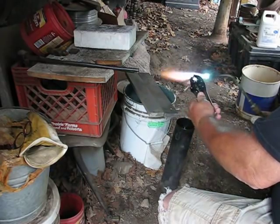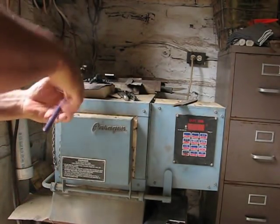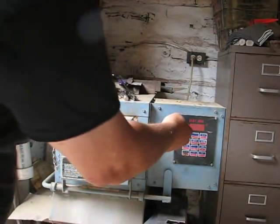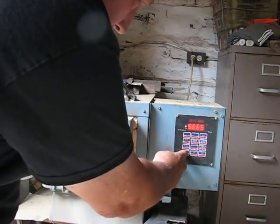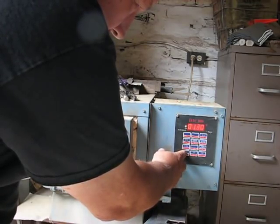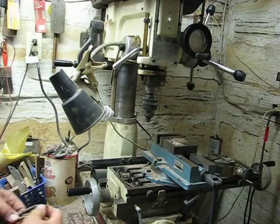I hold the knife in there about five seconds, then clean it off. It doesn't form any martensite until it gets down to 500 degrees, and it doesn't get hard until it gets down below 200 degrees. At about 350 or so it's about halfway through. I use a heat treat oven to temper with. I'll program it to run about 475 degrees for an hour and a half. I'll ramp it up at a thousand degrees per hour, hold it at 475 for an hour and a half. I do this one time, and it's not a complete transformation, which is alright with me because it gets 95% of it. And I figure those 5% are the little boogers that help me cut.